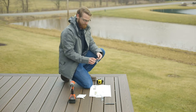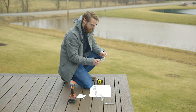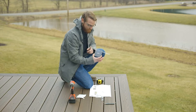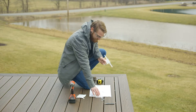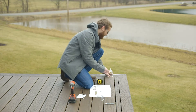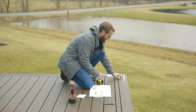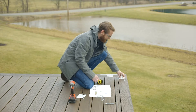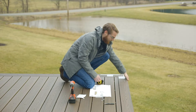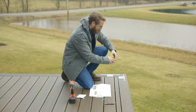You've received your template kit and inside that kit you're going to have your acrylic templates. This is going to represent the foot of the Ascend Talon and the termination of the glass itself. We're going to take two of these and start on a corner condition. Set our templates in, ensuring that the foot is going directly into the mounting material and not over and directly through your overhang. Take into account that overhang on this deck here.